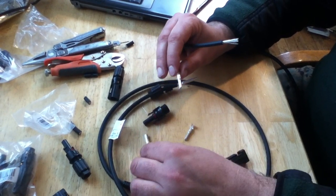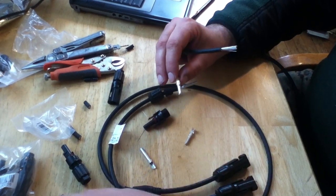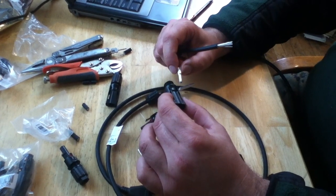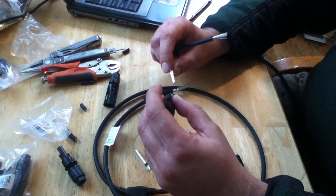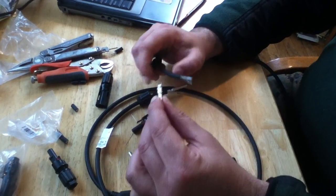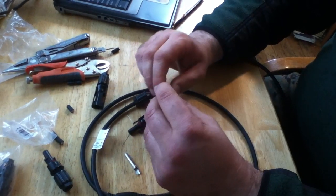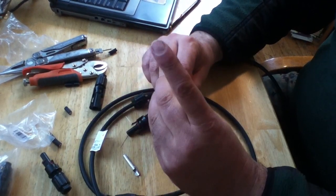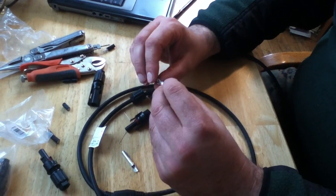The wire reaches up inside the shaft. On what's normally the male side, the inner wire actually ends up being on the female side of the outer connector, so it's difficult to call these things a simple male-female arrangement. Basically the slightly larger square one gets the internal male piece, and that goes on the end of a spliced wire. You can actually insert the wire all the way up the shaft so it's never going to become an issue with making it fit.